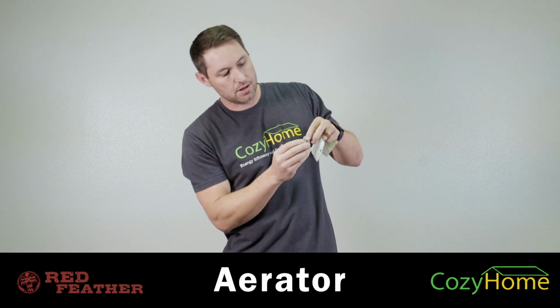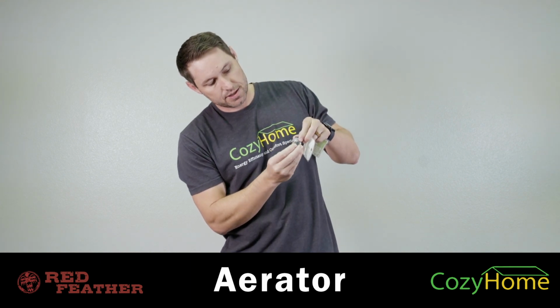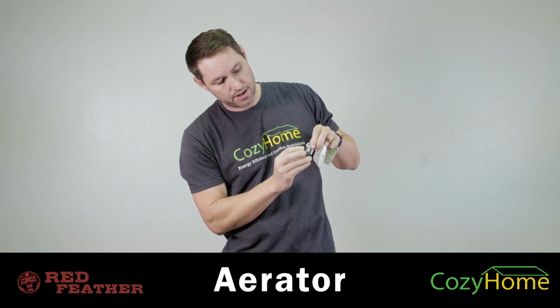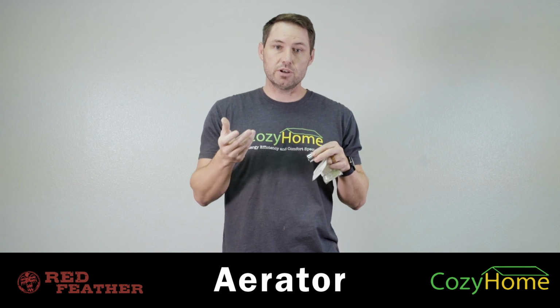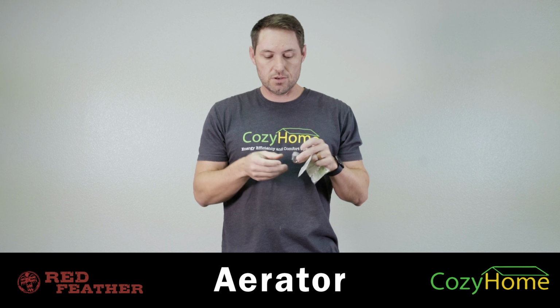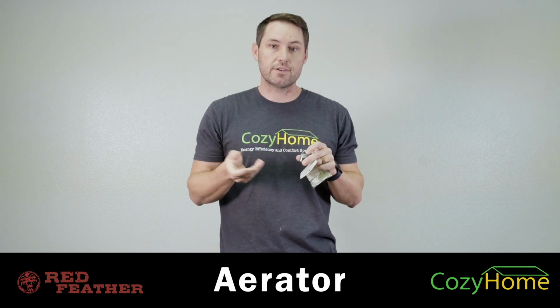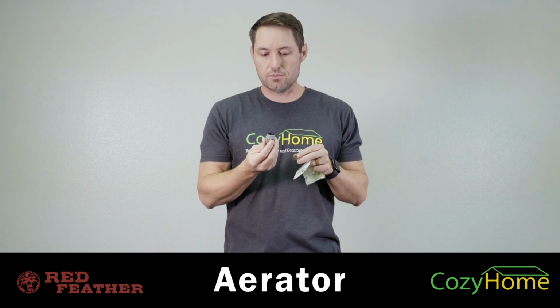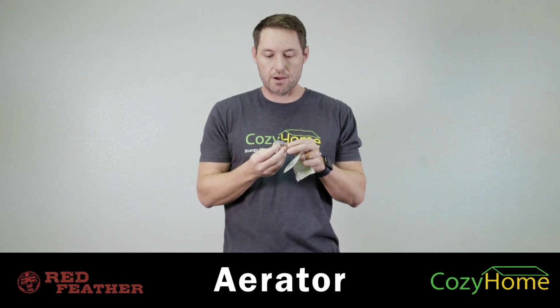These ones are really cool because they're adjustable flow. They have a little thing on here that, as you twist it, can change from 1.5 gallons per minute all the way down to 0.5 gallons per minute. So if you're brushing your teeth and you don't need a lot of pressure coming out of the water, then you can use maybe the 0.5 gallons per minute. Or if you are waiting for the water to heat up, you can use that as well. So it's a nice way to adjust how much water is coming out.